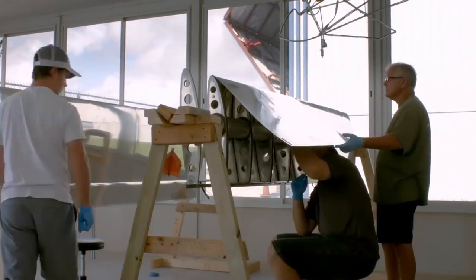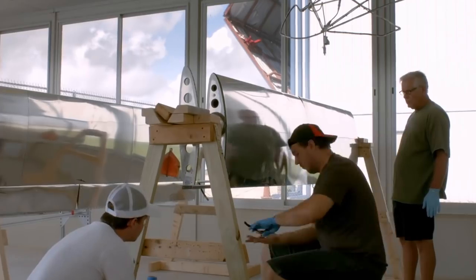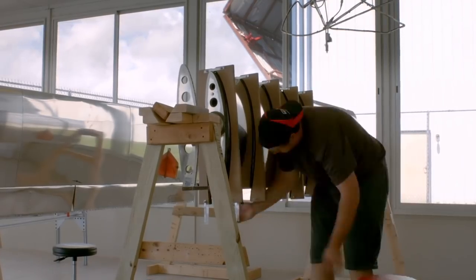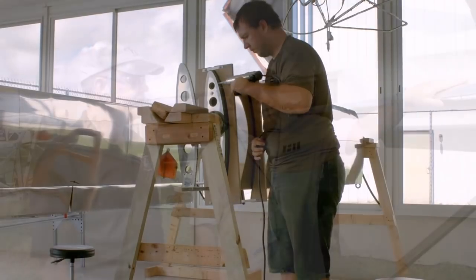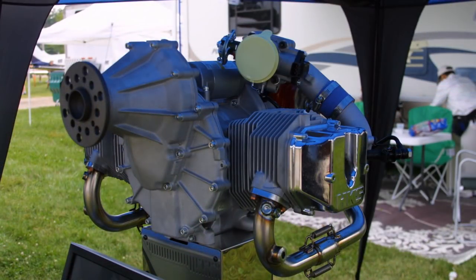The wing itself is one we've been using for about nine or ten years, with honeycomb ribs bonded onto the spar and then the skin bonded onto that — that's what forms the leading edge. The fuel cells are inside the wing; this one will hold about 20 gallons, and you could open up more if you need to. With the HKS engine, that's quite a lot — it's a very miserly engine, so you get several hours of flight.